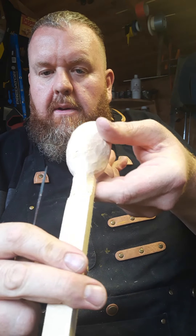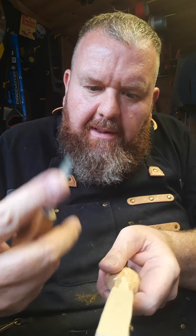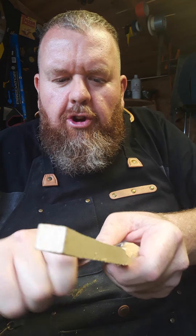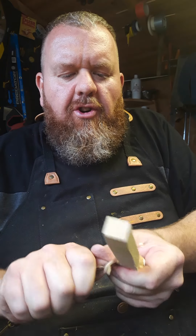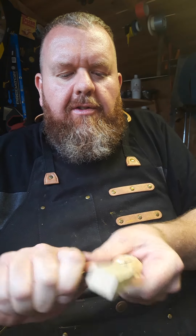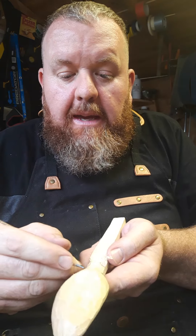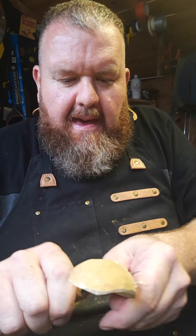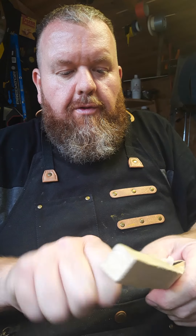You can go a bit further down — this is where you use about three quarters of the knife blade. When it starts to turn, you can turn the knife in to get the shape you require. It's always nice to have a good smooth transition. Try to keep the highest point in the middle. If you want to make it easier, keep that center line as a guide. Shave cuts down, turn the knife around, and remove the material.